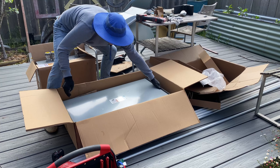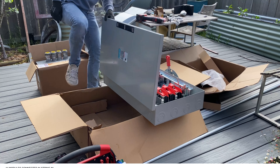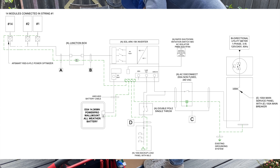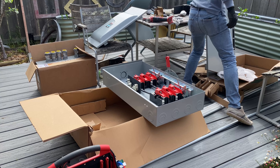All wires between the AC disconnects, main electrical panel, and Solark unit will go inside the garage. We have unfinished walls there and it's going to be much cleaner if we run cables in the wall. Here is the 200A double throw switch — we're going to use this to switch power to the subpanel from Solark to grid, just in case we need to service the inverter.